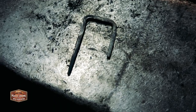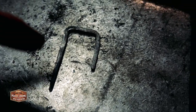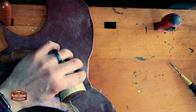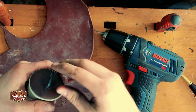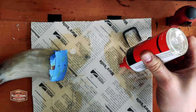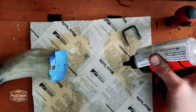So here's our staple. We don't have it perfectly even all the way around, but we're going to nip this off and use our file to sharpen these up a little bit so we can add it to our horn. Back on the bench, I'm using a drill bit that's just a touch larger than the points on my horn staple. My goal is to drill just enough that the horn staple will go in but will need to be forced in — this makes sure the staple's not going to pop out, and this small hole gives me a chance to make sure that this doesn't split as we're driving the staple in.